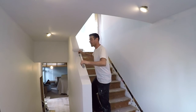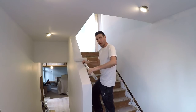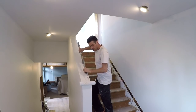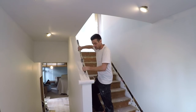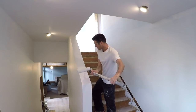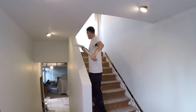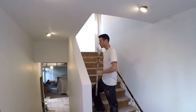What I'm doing now is I am not pressing hard — basically the weight of the tool is what's doing the job. It takes a little bit longer to get total coverage here, but the important thing is I'm not mashing the paint over the edges. It takes a little longer to get that really nice coverage and make sure there isn't any bare drywall mud under here. But I also have no spillover. Let's take a look at both sides of this now.